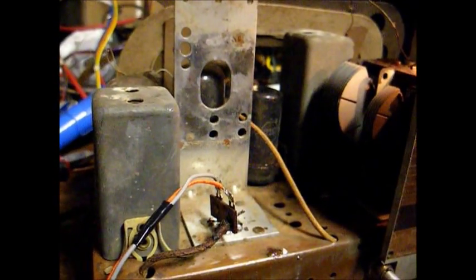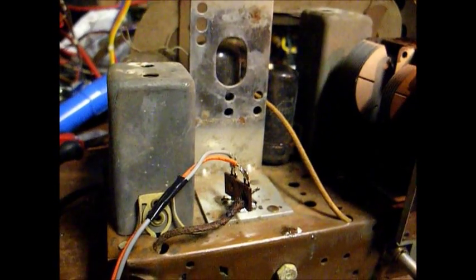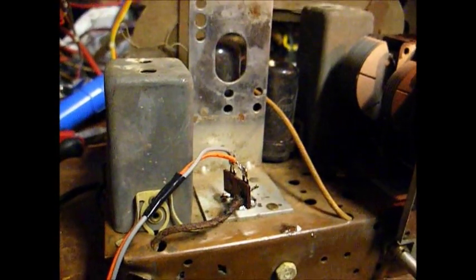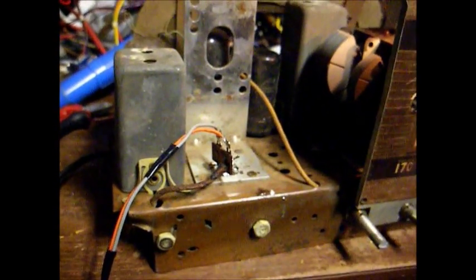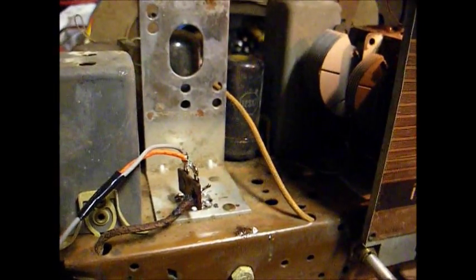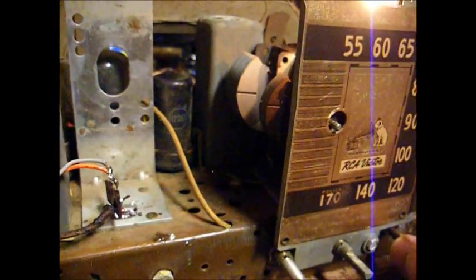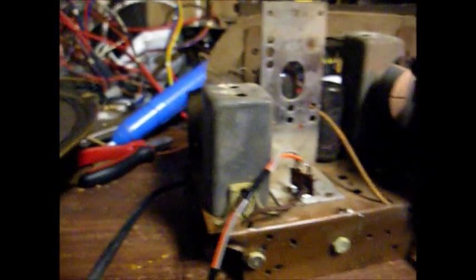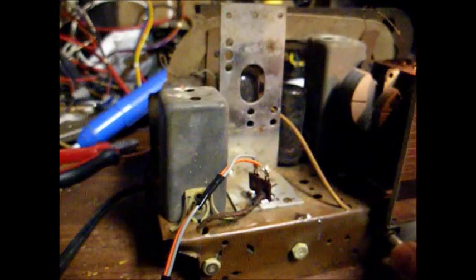And we'll replace the 12SQ7 that's weak and take care of the sloppiness where they modified this with a phono input. But we'll do that in the next video. We're about out of time for this video. But I think we've made great progress here.